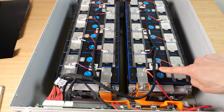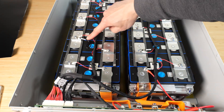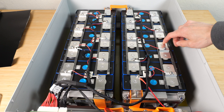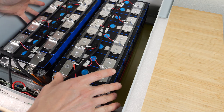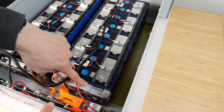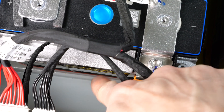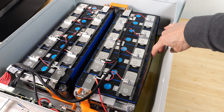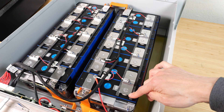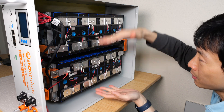You also have your typical battery sense lines — all these red wires snaking everywhere tap off of each battery cell: B0, 1, 2 through 14, 15, 16. The temperature sensors use two wires each, so eight wires total. All these tabs are not connected by bolts — they are spot welded, and they look very sturdy. The batteries are divided into two 8-cell sections, each around 24 volts. On each end there are cast aluminum blocks, strapped together with a metal strip. The metal strap is actually welded together, so there's no way it's coming out. These straps hold the whole stack together, and the welded posts provide structural integrity. The entire thing can be mounted sideways.